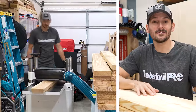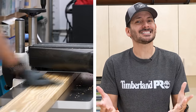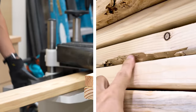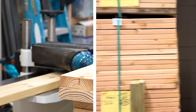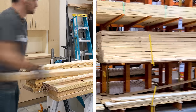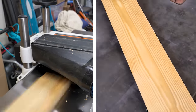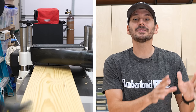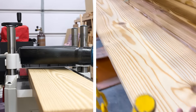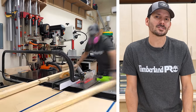There are a lot of different options as you go down the lumber aisle between sizes and types of wood. You might just be thinking you'll grab some two by fours because they're cheap — that's not usually a great idea because they have a lot of small knots, and the edges can get really gnarly. The color ranges from pale white up to a really splotchy pink. What you want to do is head to the back of the store and go where the large construction grade lumber is — your two by sixes to two by twelves — because those boards typically have much fewer knots, and you can pick out the best ones no matter what size they are.